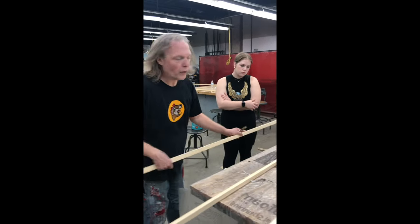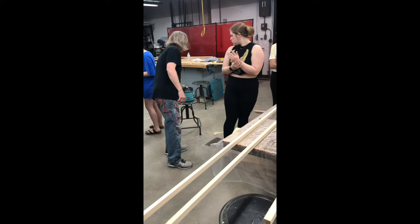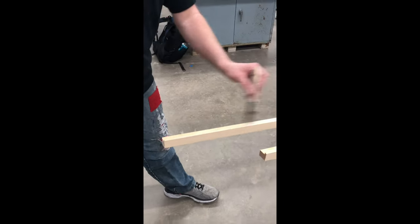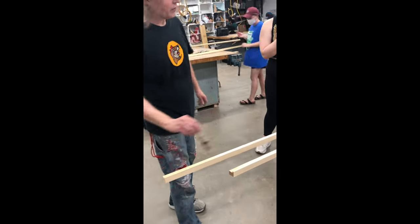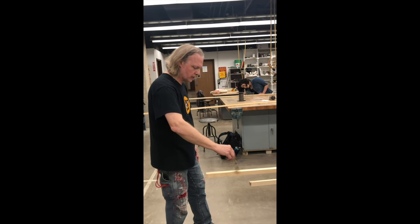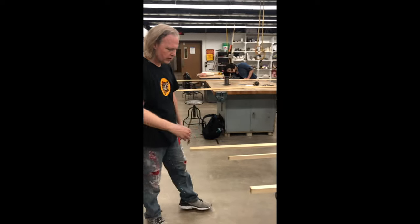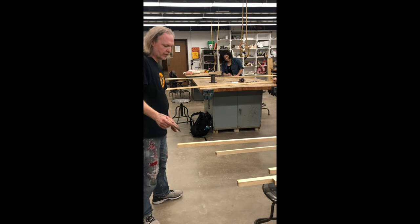The way I like to suggest doing this is laying it on its back first, and we'll kind of have to share. That's okay. I'm gonna work inside the front of the lip, the inside, and I'm gonna go down again with the grain. I'm never gonna do this. Always going with the grain of the wood. Then once I've gone down the entire length, I'm gonna go back and turn it up. I've noticed there's been some drip there. I wanna really make sure that I feather that out and don't let that stay, and I'll show you why in a second. All the way down, then I'm gonna turn it so it's right on that edge, and then go down the back. Then I'm gonna set it up and we'll let it cure and set.